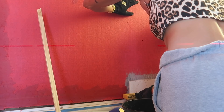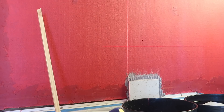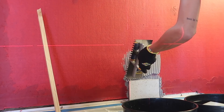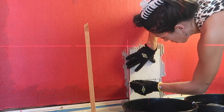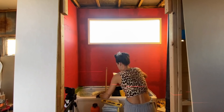These are completely flat — we just lined them up with each other. My dad, when I tiled with him, that's the thing that drove him crazy: making sure all of them were flat to the wall. I add spacers and do the next tile, taking it at a slow pace, tile by tile. The thinset trowel marks should go in one direction — that is preferred. When you smoosh it after back-buttering, you want the thinset to basically ooze out of every side, because if you don't, you have air pockets and that can crack your tile.